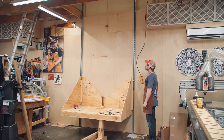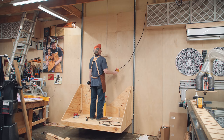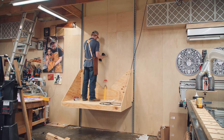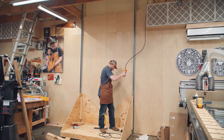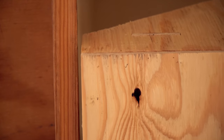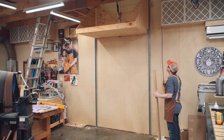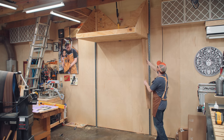Down comes the cable and I can test the entire setup for the first time. I had two immediate observations. First, there's a little bit of a spring to the lift when I bounce on the platform. I initially thought that this was from the super strut bending under the weight, but I now know it was more from the super strut twisting as the weight is applied to the lift. This is because the mounting location of the hoist is not directly above the cable as it enters and exits the hoist — instead, the mounting location is just centered on the back of the housing. So I ended up solving this a few days later by adding a pulley to the platform itself to double up the line and securing the end of the cable to the opposite side of the rotation on the super strut. The second thing I noticed is a few of the screw heads in the super strut were way too high and this caused a little bit of random interference with the trolley blocks. Drilling the countersink slightly deeper was an easy fix.